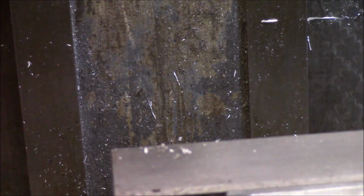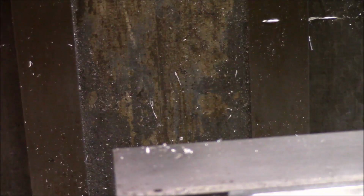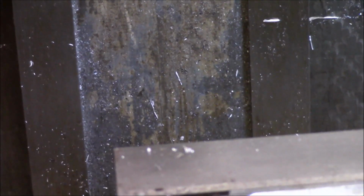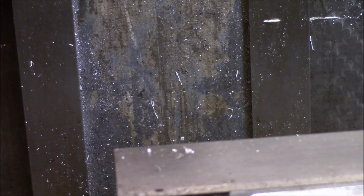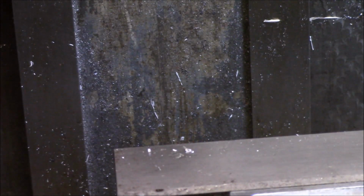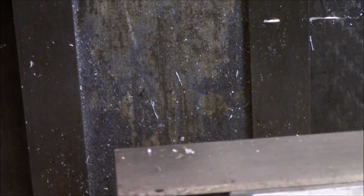then we're going to reset back up to fix the problem. What I discovered in my trial fit up is when I put my fixture on the grinder, the grinder's not going to have enough travel. Again, I kind of worked this off in my head because I didn't have any exact dimensions. So what I'm going to have to do is go back and mill everything up to here and add about this much more slot to get the fixture up. See, the way my Baldor is designed, there's a base this is going to rest on. So that's kind of where we're working from.